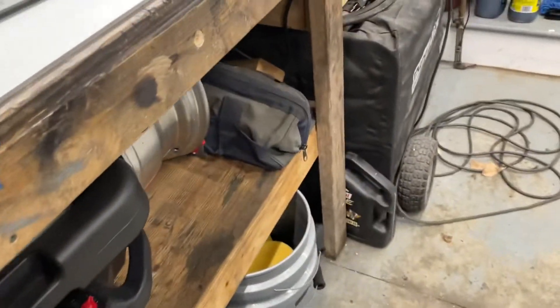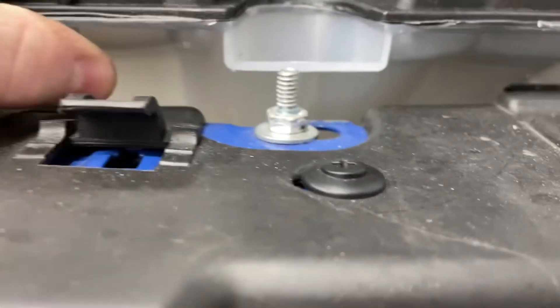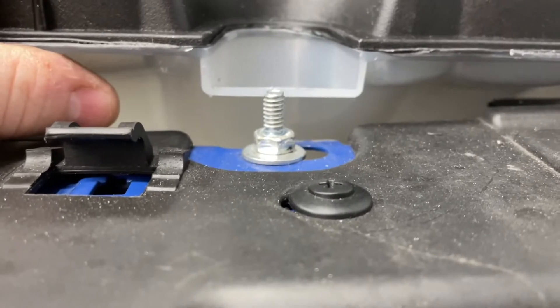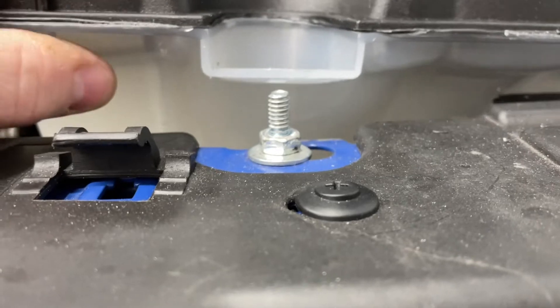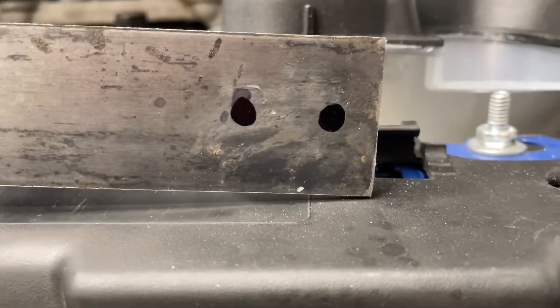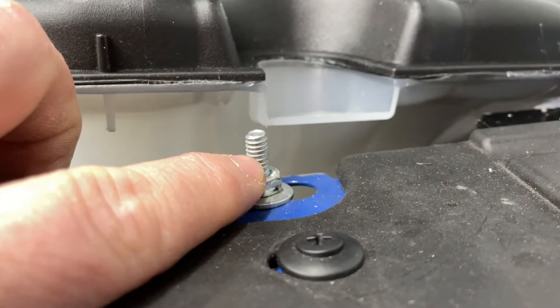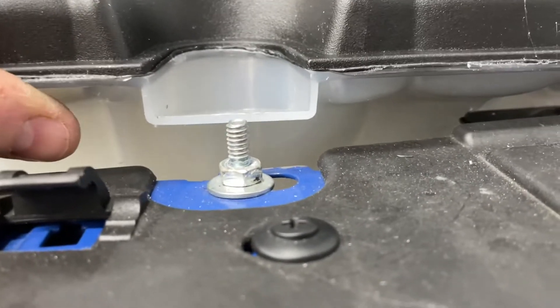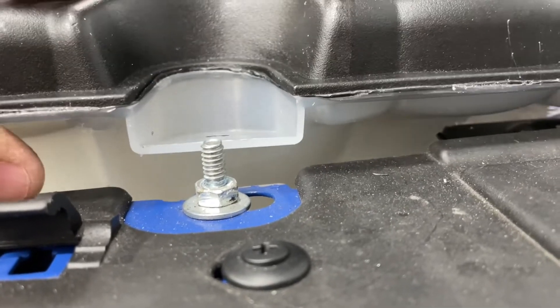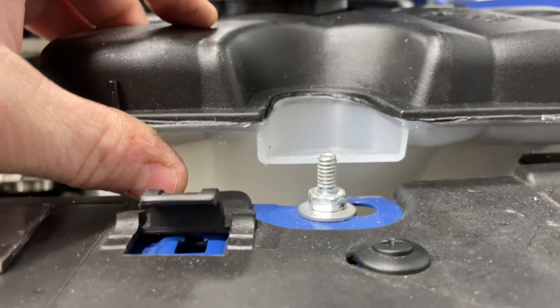A little change of plans. I can't make a small enough offset or dog leg in that flat bar. Anyway, I got looking at this and I think I can just drill two holes in the flat bar, and then add another nut here to sort of make up for that offset — that bend, dog leg, whatever you want to call it — that I can't make in the flat bar. I'm going to try that out. Hopefully that will work, and if not we'll come back and try something else.